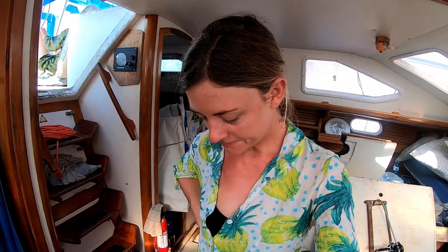So the through-hulls, and basically there's pitting on the inside and the outside of the hull. We need to clean it and sand it and work out how deep the pitting is to make sure we don't need any welding. At this stage it doesn't look like we will, but that will obviously change things a lot if we do.